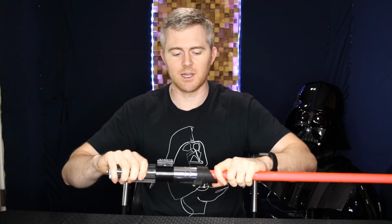It's a fantastic system because you don't have to worry about the power being on or off. You don't have to worry about orientation, like with the more stable blade connectors, like the GX stuff or aviation plugs, whatever you want to call them, where they have multi-pins. Those are great. They're super strong and a super good connection, but you have to make sure that they're oriented correctly when you plug the blade in. In other words, you have to put the blade in and twist it until you feel it click in. And for any of you that wear any sort of costume with headgear, it's impossible to see everything you're doing. Whereas this is just plug in, and it's ready to go. Power on, power off, doesn't matter.